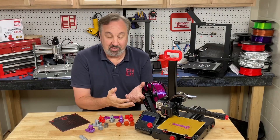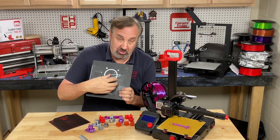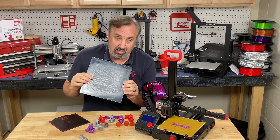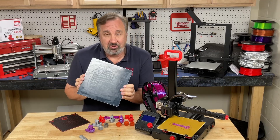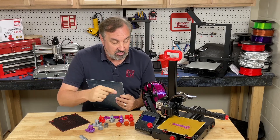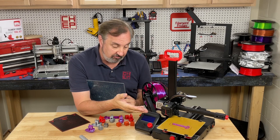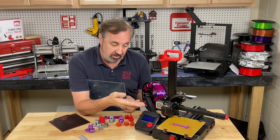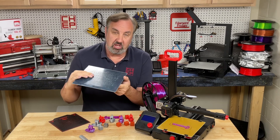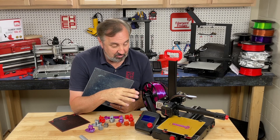Why it took me so long to try this, I don't know. When I did my Neptune 2 review I didn't like the bed because everything stuck so well I couldn't get prints off. I ended up flipping the board over and printing on the other side easily — and I thought it was a great material, but I didn't realize it's the same stuff, just thinner. I like this thickness: it's 1.6mm thick — basically 1.5mm FR4 with a copper layer on top. It's thick and firm so it stays flat, though one board did have a little warping in the center. Overall, I'm going to use this circuit board material for more prints.